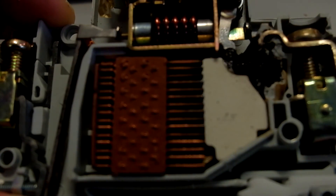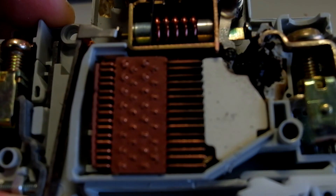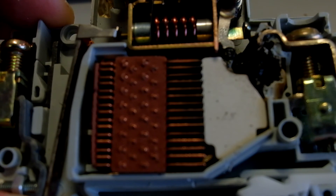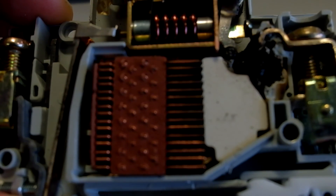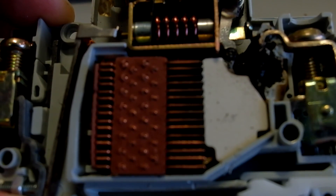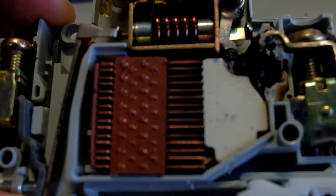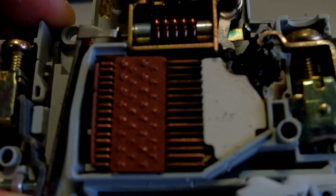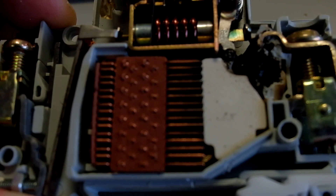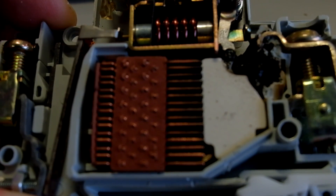So the suspicion is confirmed: because this is a 16 amp radial circuit in the kitchen, if you have a dishwasher and a kettle on at the same time you could have two kilowatts plus three kilowatts - five kilowatts, over 20 amps. That is an overload situation for this 16 amp breaker. If that's been happening over a number of years - yes, the kettle is only on for two or three minutes - but over a number of years the thermal overload has burnt out and the device has failed. To be fair to the device, it did actually trip out; you just can't reset it. It's now faulty and we've replaced it with a new 16 amp breaker. Thank you for watching.